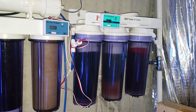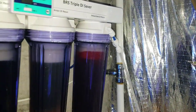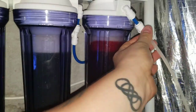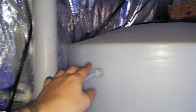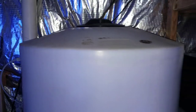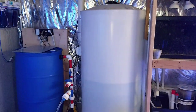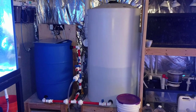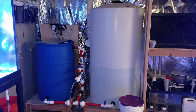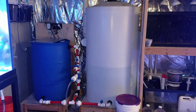I make a lot of water relatively quickly, which then comes out of here. It comes in through here — I went ahead and used a SharkBite and then one of these valves I picked up at Home Depot. When it comes out, it makes sure it is zero TDS, and then it comes over here to the RODI storage unit, which is 160 gallons. There is a float valve inside, capped off so all the dust and stuff doesn't get in there. That barrel I picked up at a Chemtainer factory here locally, towards Lancaster. It's not the cheapest container, but it is safe for RODI water — and again, it's 160 gallons.